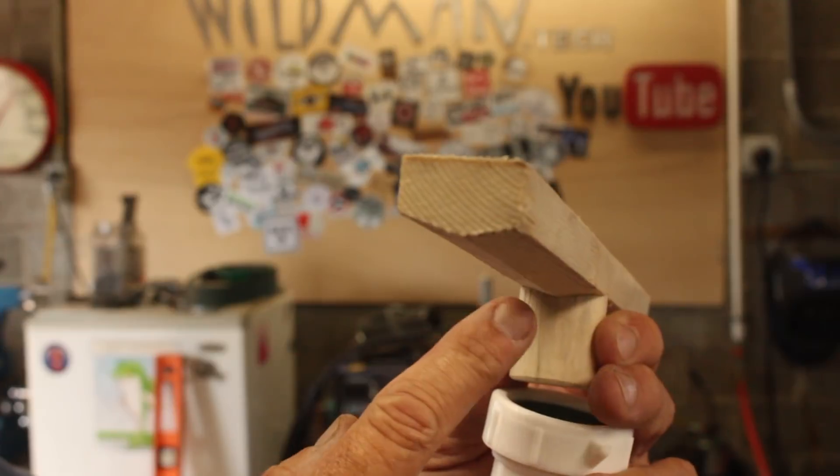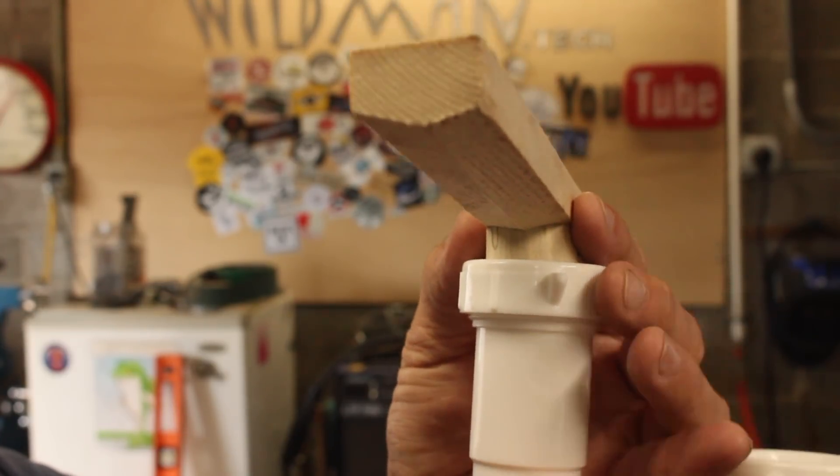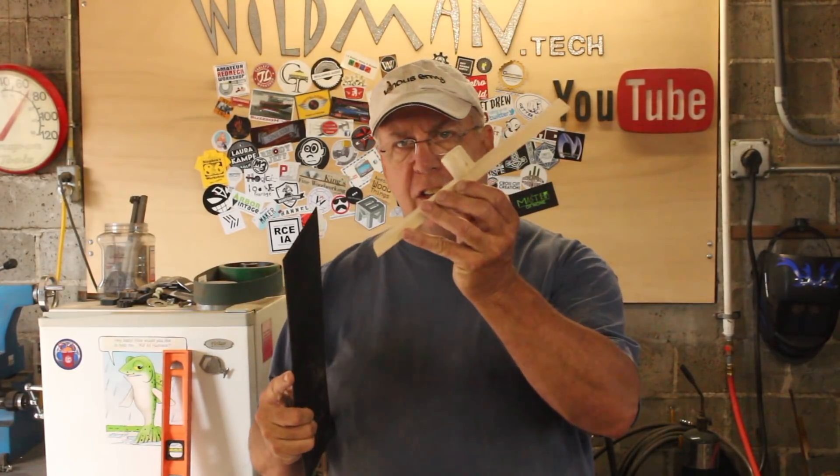The way I want to accomplish this interface is with a drain pan that will come down to a tube that will plug into the P-trap. What we're going to do today is stretch heated ABS plastic over the top of the form and then use vacuum to suck it down onto the form. The project starts with a box that will be the vacuum chamber, which will suck the plastic down onto the wooden form.